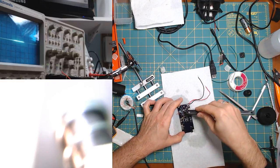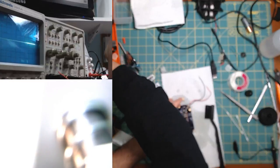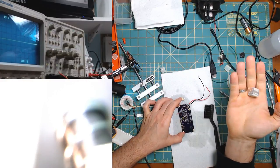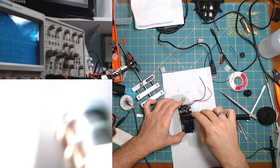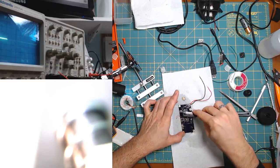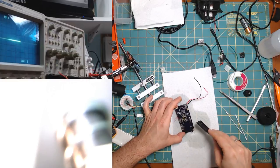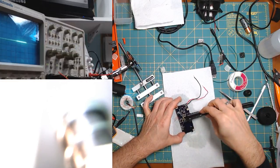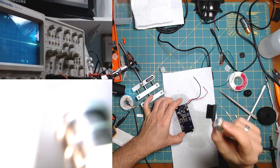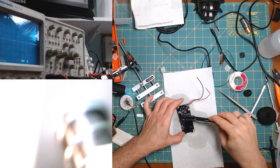But mostly I'm just excited to get it back in actual dice form, just like I have for the previous version. So this was version one, and they're okay, but they have several issues, not the least of which is that if I bump them too hard, they reboot because the battery connections get loose. Because I'm not using rechargeable batteries, I can't solder them in, so I have little contacts. But as much as I try, I just can't get them to stay on properly. So yeah, I'm just anxious to get started on the next one.